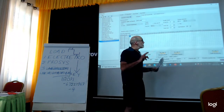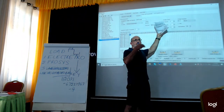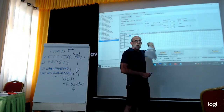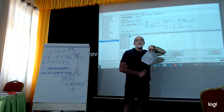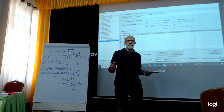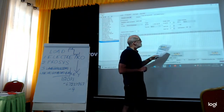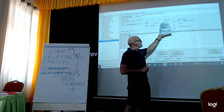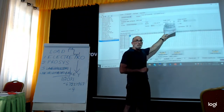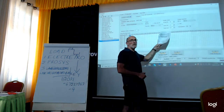And I'll explain that in a minute. This is the Q. This is a quality measure. What quality measure? How much difference is there in the readings it's taking? So this is a standard deviation. And we do a lot of work in noisier environments, so we sacrifice some quality to be able to collect a data point. So we tend to use this number as 5%. You could set it at 3% or 1%. Or if you're in a very noisy situation, then you might choose a little bit higher.